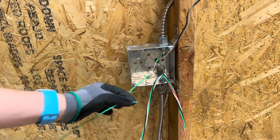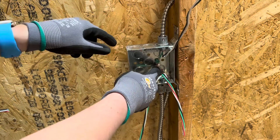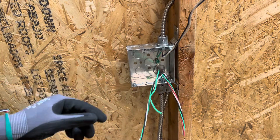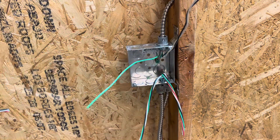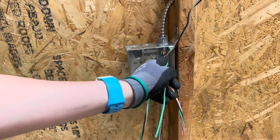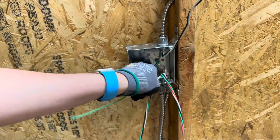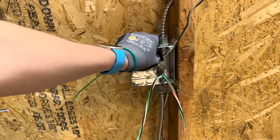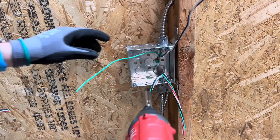Once you have your wire stripped, wrap it around clockwise because it'll tighten itself. If you wrap it counterclockwise and then tighten the screw, it's going to loosen the wire — you don't want that. Always wrap your ground wires clockwise. You can do the U-shape method or wrap it around one and a half times. I usually just do the U-shape, but you can also crimp it so it's nice and tight around the screw, then hit it with your impact driver or tighten it with your screwdriver.